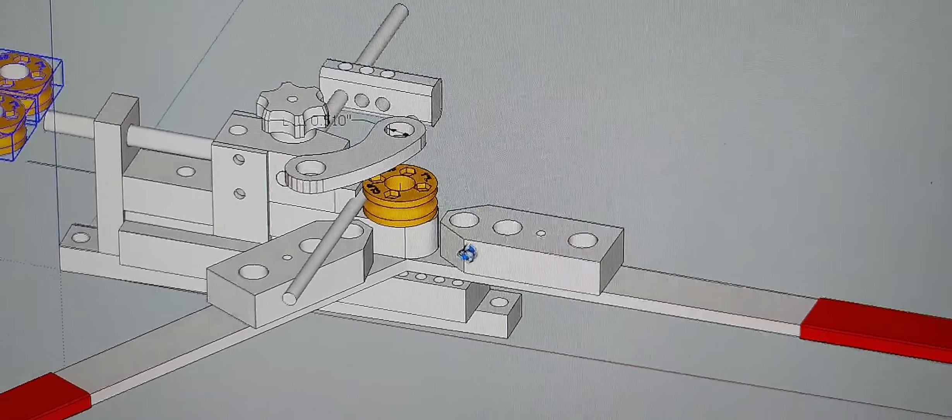As you can see here, it can bend with precision quarter-inch aluminum tubing, and it can probably bend up to maybe half-inch tubing with the proper dies. These are designed for quarter-inch tubing. As you see here, they have markings, and these dies are done so that the total length of the curvature required to get a 90-degree bend is exactly one inch.